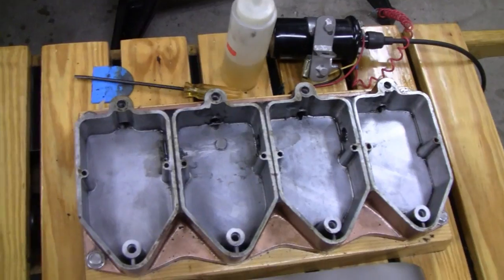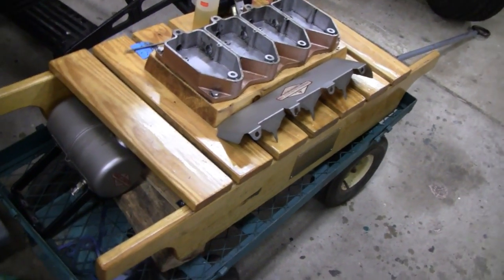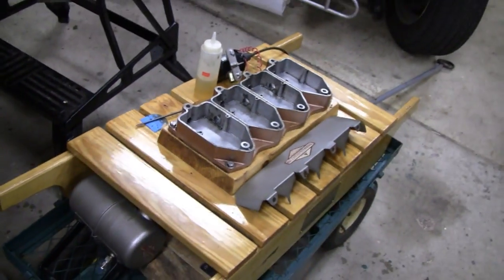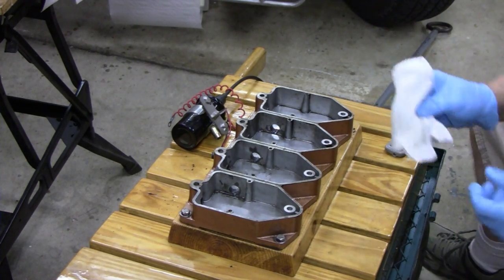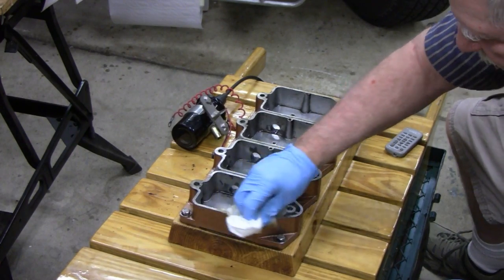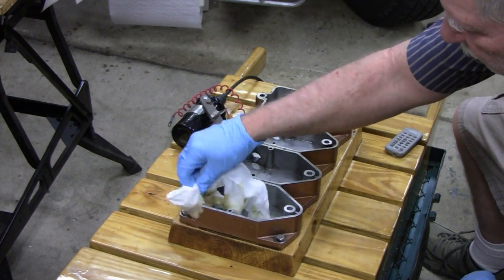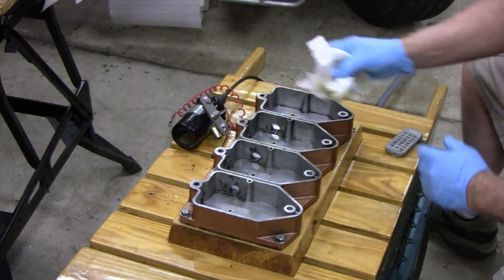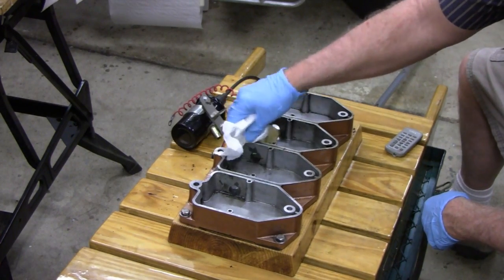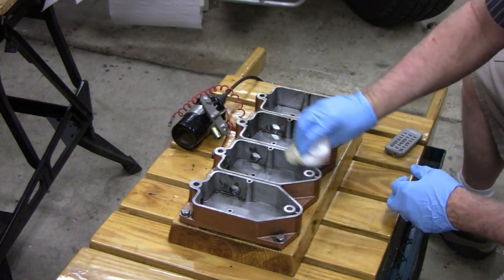I was going to move this and put it up on a bench, but I forgot it's all bolted together — the base is bolted to the wood, and the wood is bolted to the little stretcher cart, and then you got the generator and batteries in there. It's about 80 pounds so we're going to make our gasket right where it's at. I'll put some lacquer thinner on a paper towel and just clean off all these surfaces. See that brown stuff? That's Indian head — that's the shellac that holds the gaskets on. I don't plan on taking it off, but since it's coming off I'll take it off.